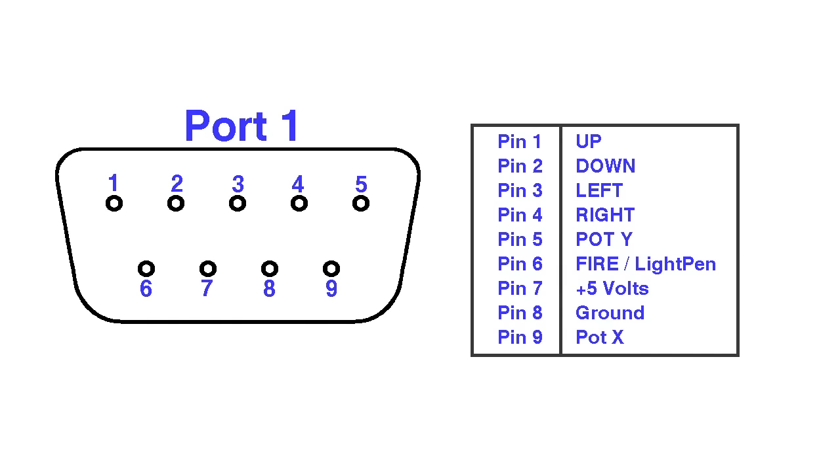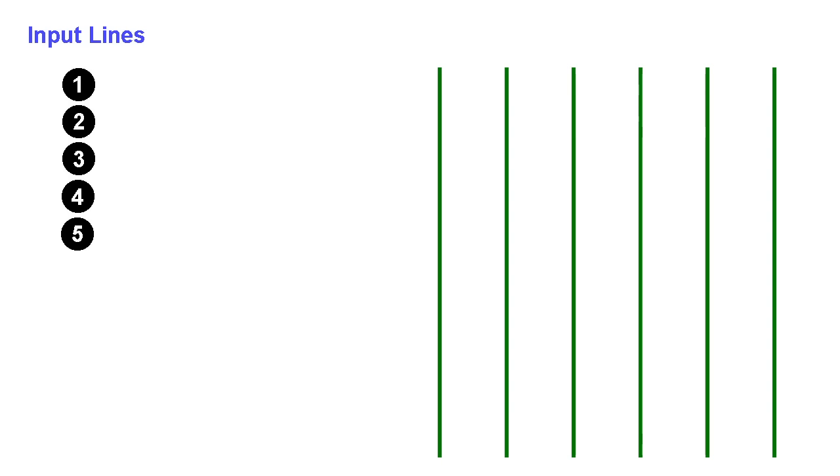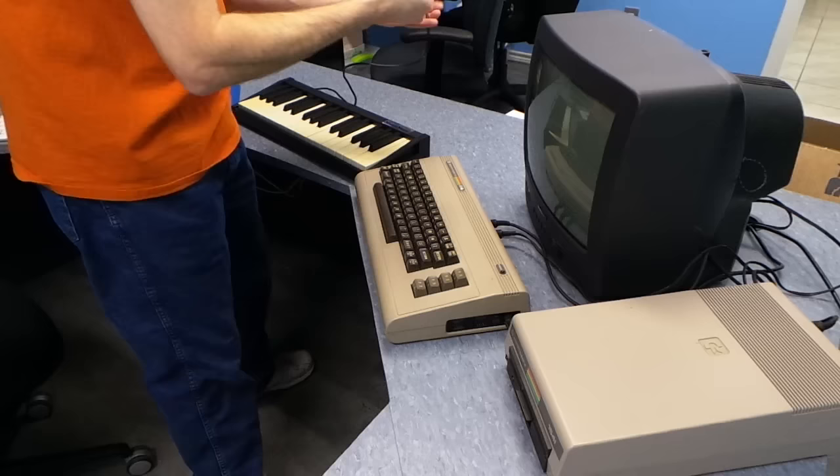One of the reasons I find this device immediately fascinating is because it connects to the joystick port. Now that may seem perfectly normal to a lot of people, but it baffles me. Look at the joystick port and you'll see that there are only 5 digital input-output lines available, and yet there are 32 keys. Even if this were wired into a matrix, you would still need at least 9 digital lines to make that work. So that leaves me wondering if there's some kind of brain inside this keyboard converting the keys to some kind of serial data — which the joystick ports on the C64 are capable of, even though they were rarely used that way.